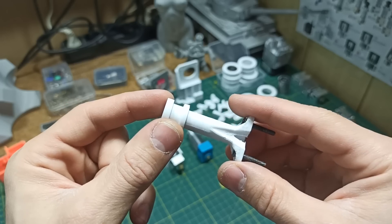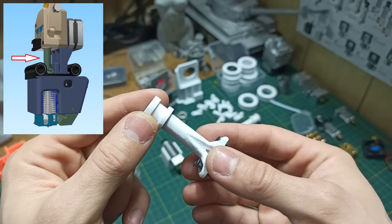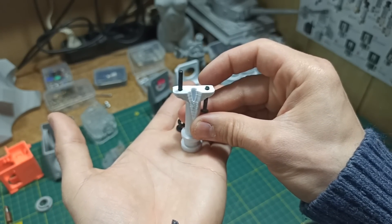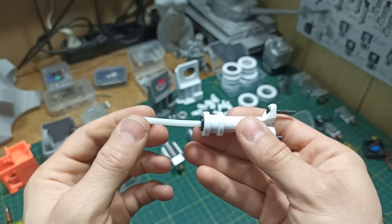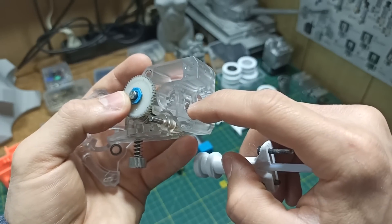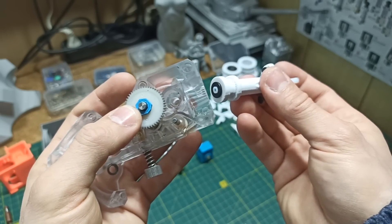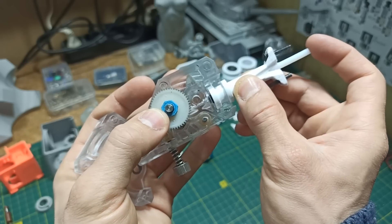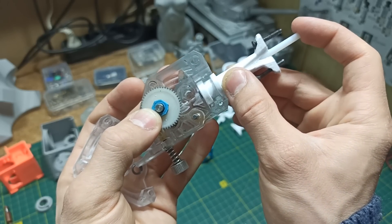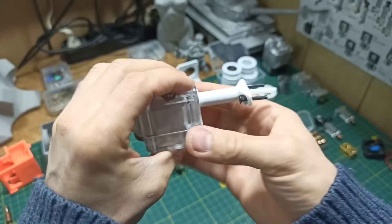This leg is a long-awaited upgrade that will connect the BMG feeder and the carriage, so there will be no deflections or bending, and high rigidity will be added. Here we have a seating for the BMG. Print with supports in this orientation. We insert the plastic fitting — the tube goes in without problems, but cannot be pulled out. We take the feeder from Mellow Store. Note that there is a seating here — it is designed specifically for our feeding mechanism inside the BMG itself. Operation is very simple: our leg moves freely. If you simply press on the PTFE, it doesn't push through. But if you slide it slightly forward, the PTFE now pushes all the way through. And here we go — fixed. Very rigidly. No play whatsoever. Sits absolutely solid.